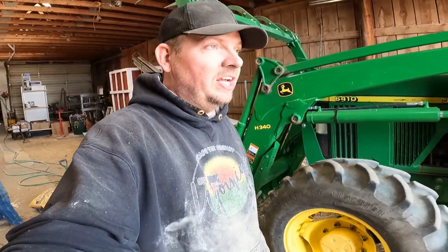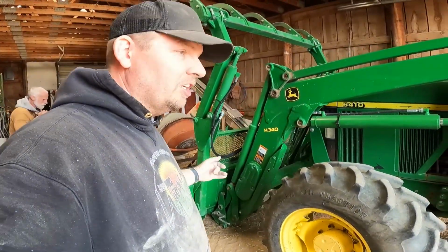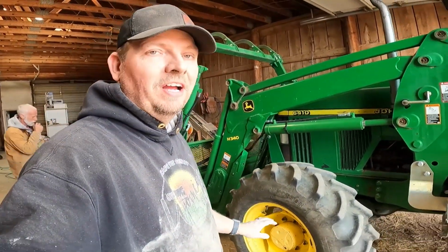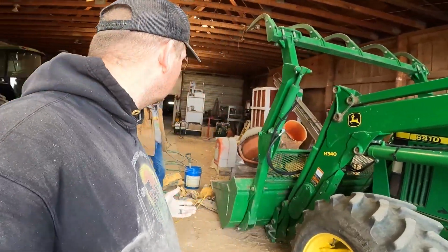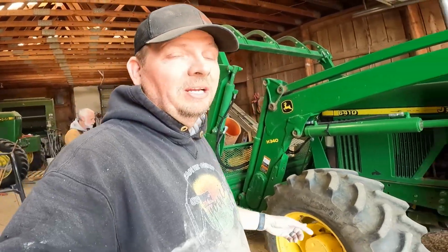That is a whole lot of concrete. We've got about 2,000 pounds of concrete. Add in water, I'm guessing about 2,500 pounds or so. And now it's time to move it over to our form, which isn't that far. What, 50 feet, 60 feet, something like that. Not too bad. We're gonna move it over there and slowly get it dumped in.